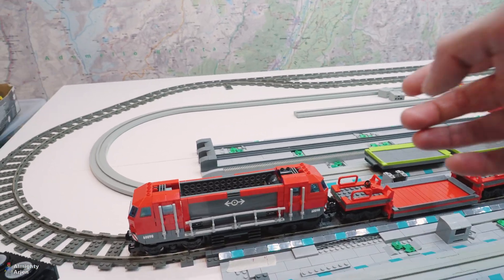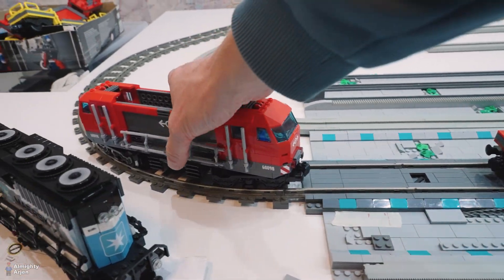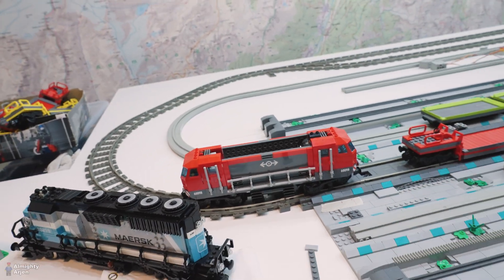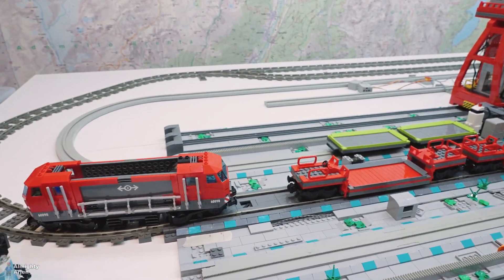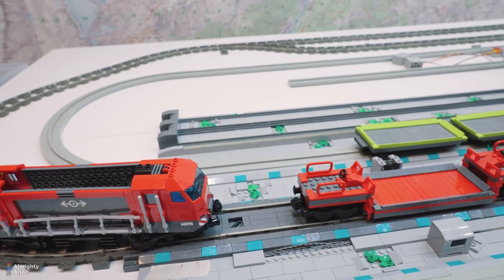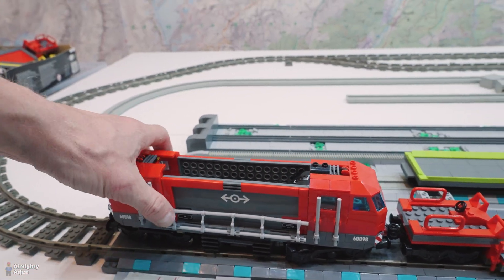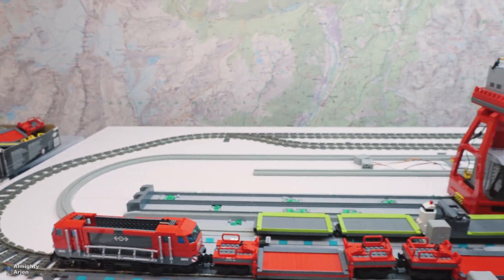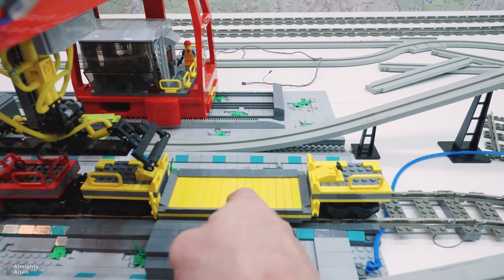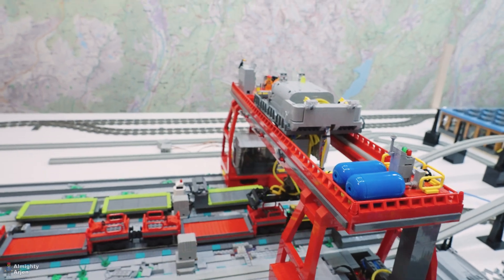So I made another sensor over here. What this one does is it sees the magnet underneath the train — every locomotive is going to have a magnet underneath it in the middle. The sensor detects that magnet, and from that point on it starts looking for the end-wagon magnet. When the locomotive magnet passes the sensor it's around this position, and the sensor is beneath the wagon. There are no more magnets passing the sensor here, except for the magnet at the end of the wagon. So by doing this, it actually works just fine.